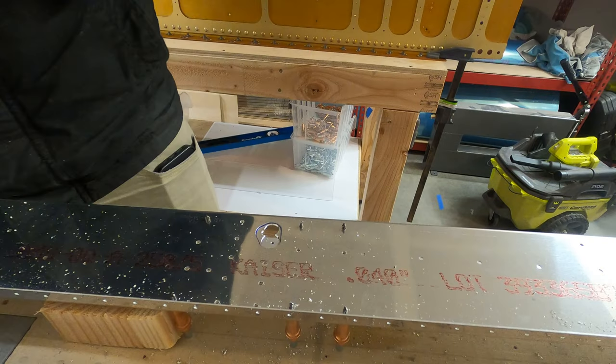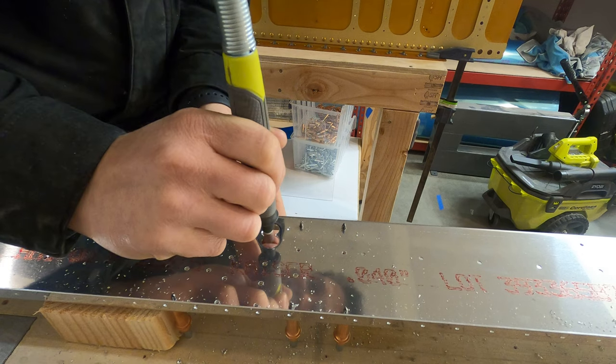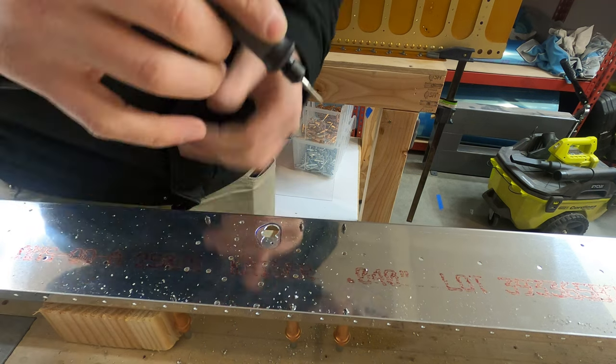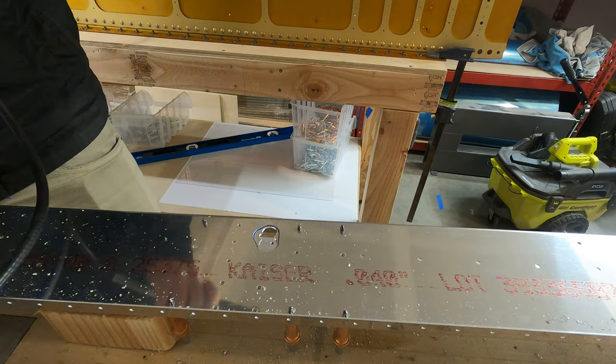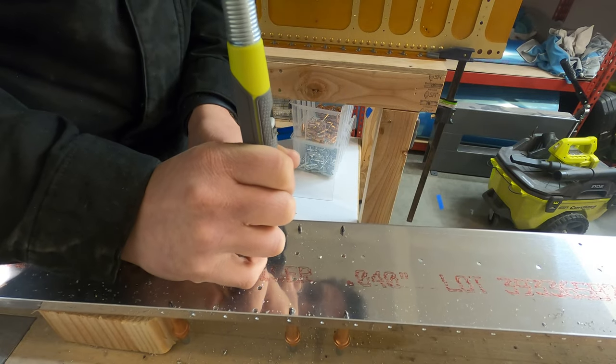So this next bit was real fun. I had to take the two or three holes that I created with the unibit, connect them all, and then expand them so that the resulting hole matched the one pre-punched in the spar. To do that, I was using the handpiece. I started with a sanding drum, and that wasn't working great. So then I went to a burr, which really didn't work great. Then I tried a ceramic deburring bit, which clogged up and bounced around. I then tried a sideways cutting drill bit, which had no hopes of getting anywhere.